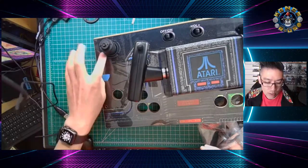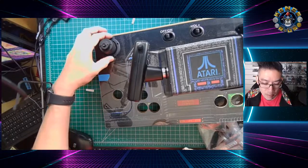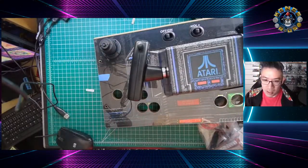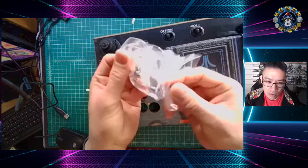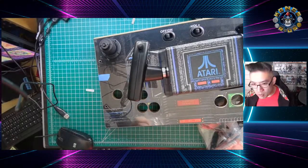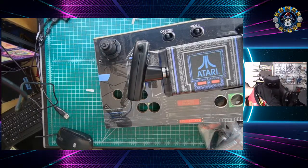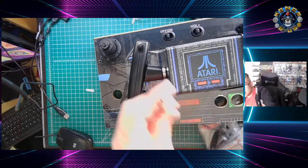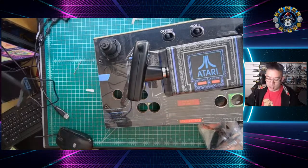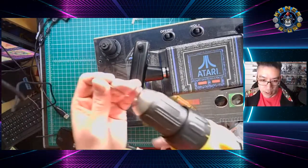Later, usually at the very end is when I mount this down, but the next step is actually putting this cover on, drilling through the plexi again, very carefully using a small drill bit. And then these are screws that actually will screw down into this. So I don't have the drill bit. Oh, actually I do have the drill bit. Maybe I'll do it right now just to finish installing it. Okay. I'll show you what I use. I use this tiny little drill bit here, and I have my drill. So I'm going to do this now just to finish the installation portion of this joystick, and then we'll get into the actual buttons itself. So, all right, just to show you guys, I'm going to install.